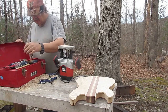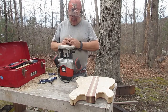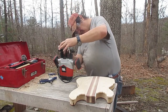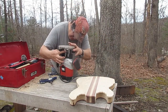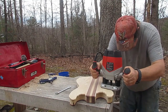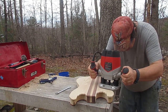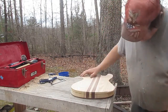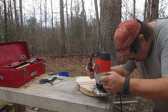I'm changing to what's known as a top-bearing router bit. Instead of having a bearing at the bottom of the bit, this bit has a bearing at the top. This allows me to turn the body over and route the little lip that's left over, because that top-bearing bit rides on the part of the body I already routed. That's how we get a clean route of the body.